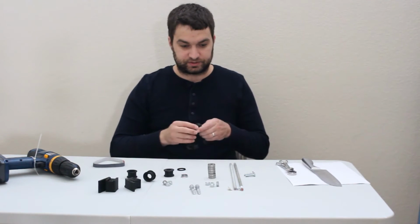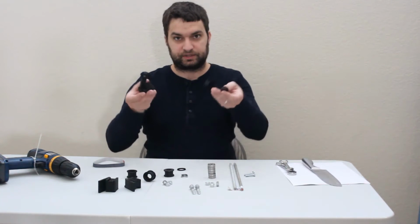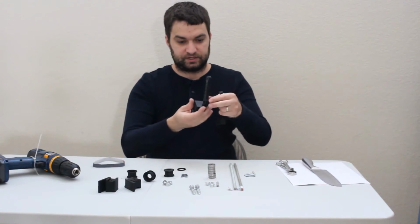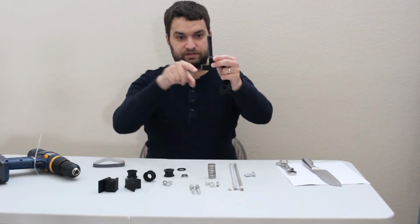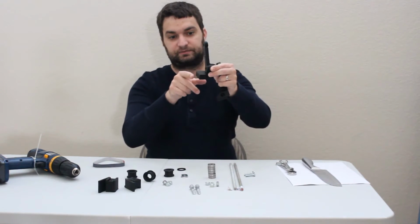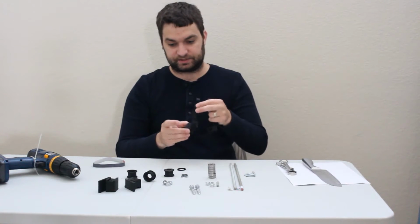The first thing we're going to want to do probably is put some pulleys on the bottom 2 corners of this. So if you're looking at it like this, the part that sticks out, that's where the tension is. We want that screw that's tensioning it to be lined up with the belt. So the pulleys go on this side, not on the opposite side.